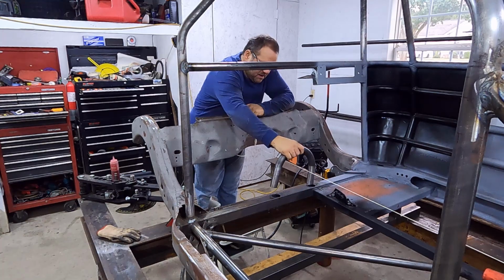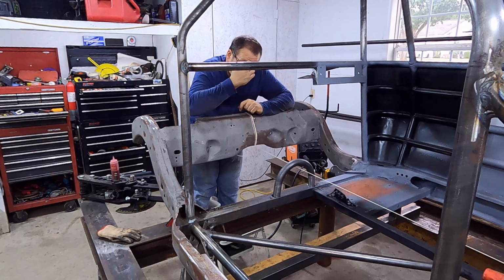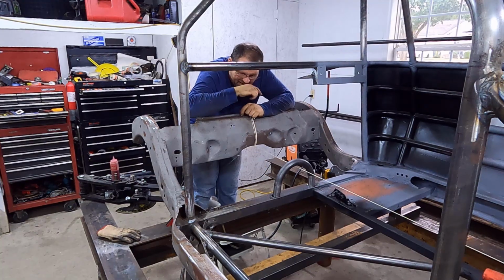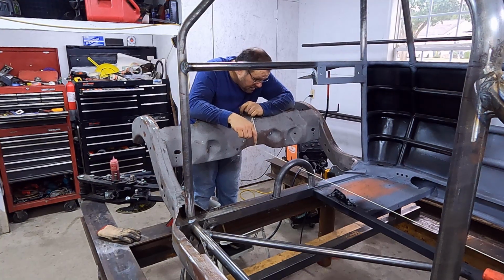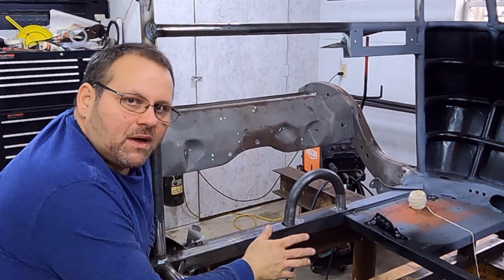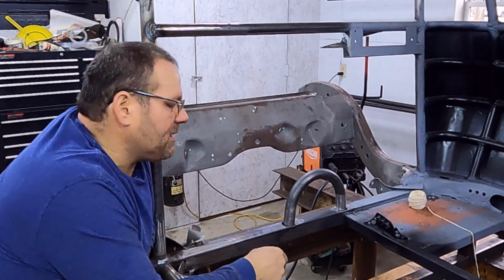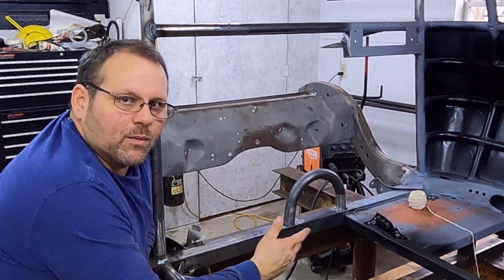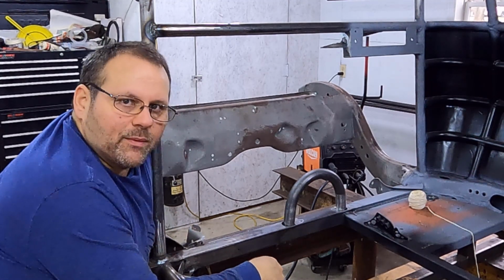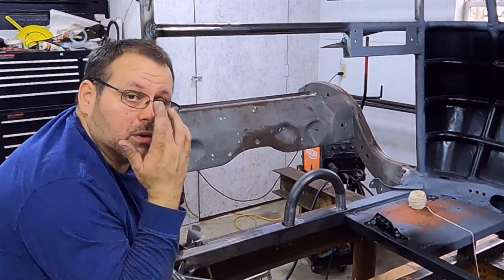See where we're at. Yep, that works. Yeah, I overcut that hole, that's for sure. That's okay. I want it to fit. I'll have to fill that in. Not my greatest day. That didn't work out exactly right. I didn't have a 1.5" hole saw, and I had a 1 5/8", which theoretically would only be a 1/16 inch of clearance if it was in the center, 1/8 on one side, and I'm like, you know what, that's fine. But in reality, when it was cutting, it was walking on me terribly, and it ended up cutting holes like 1 3/4 or larger.